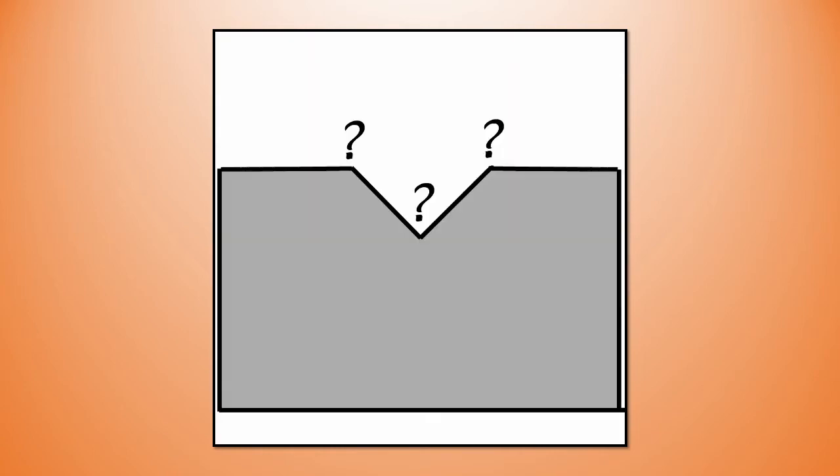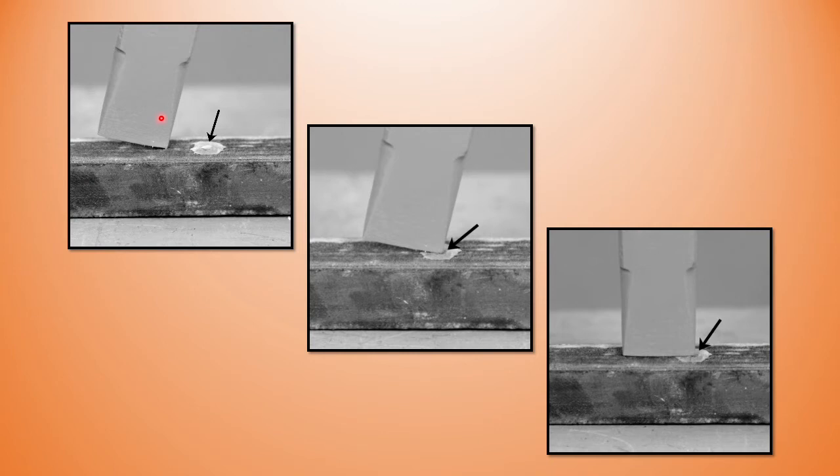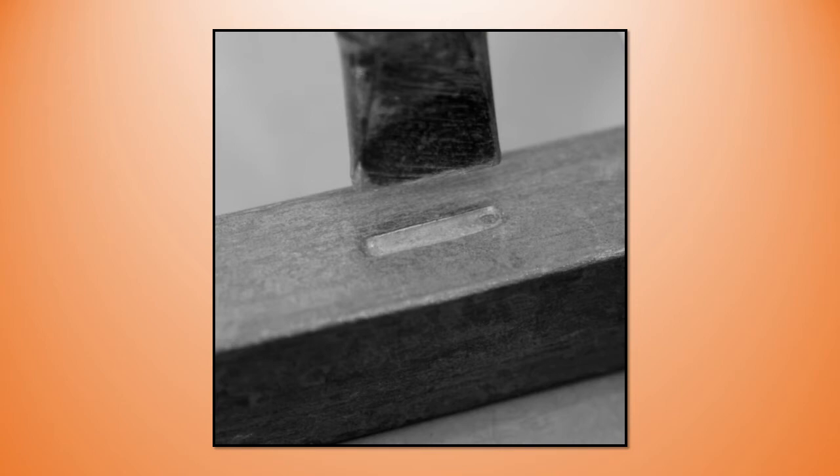What is a center punch for me? A center punch mark can be anything from a sixteenth to an eighth of an inch across the top. I put the tool away from me at an angle so just one corner is touching, pull it back until I feel it click, then stand it up and give it a whack to see if I'm in the middle. Always check to make sure you're in the middle of the bar and trust your eye — I believe the eye is more accurate than the center punch. Give it a whack, have a look, make sure you're in the right place, then carry on.